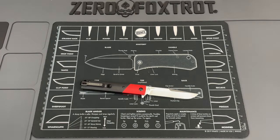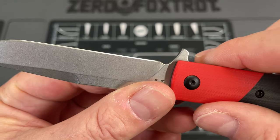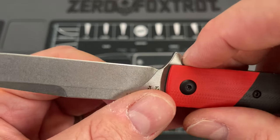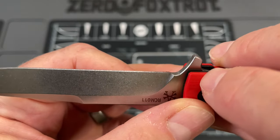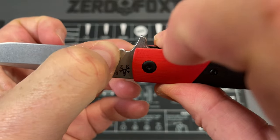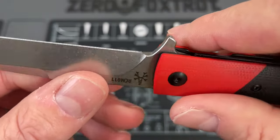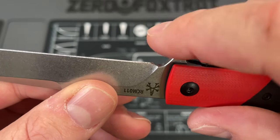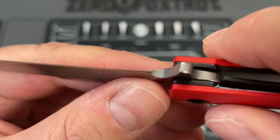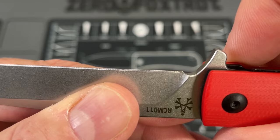Lock bar access is not the best on this, even though it's got a cutout. They probably could have left that solid instead of trying to knock out material and just softened the edge. And then the plunge — the transition from the plunge into the grind could have been done better. If you're going to have that choil, it should be functional; it needed to come out further or the grind needed to come back further. It's not a nightmare for sharpening, it's just an aesthetic thing — you're going to have a pronounced smile, and that area is definitely thicker than the rest of the grind. From the factory, it's already got that little spur, that little kick up, that little smile forming.